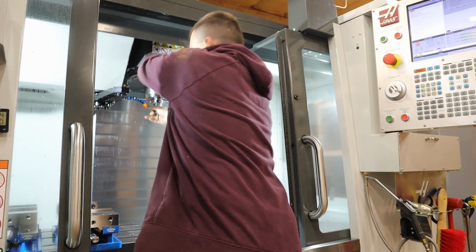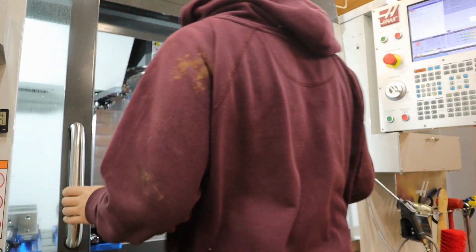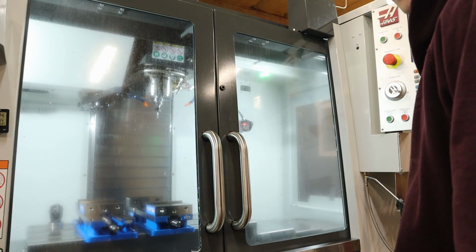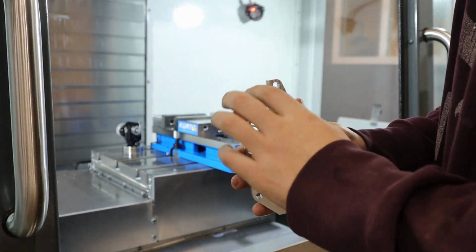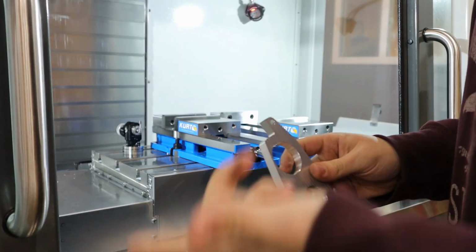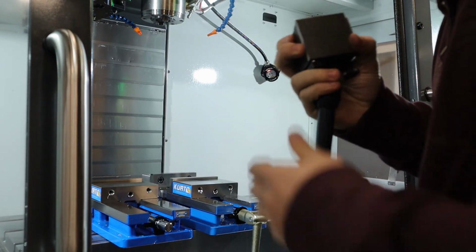Okay, let's set this tool up. Tool 3, grab your handy dandy tape measure. 4 entire inches. Not used to seeing that much length. I'm going to take this, stick it in the right vise, and then I'm going to indicate the top to make sure it's 0, 0 all the way flat, and then we'll probe it in and do G55. And take your mag base. I use one of these Noga bases, super worth the money.